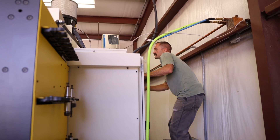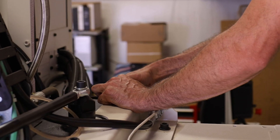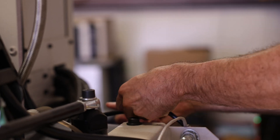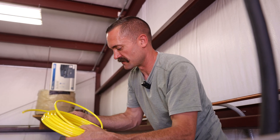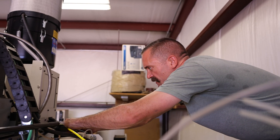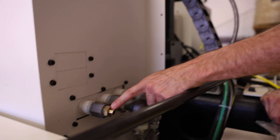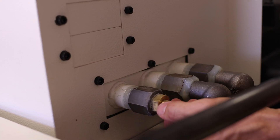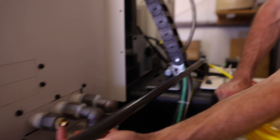We've got a simple little 8mm quick connect T — airline T. I'm going to cut this 8mm air line over here. We're going to plug in the new line. I'm going to use some yellow line just so that I know that it's the line that I modified, just in case this all doesn't go according to plan. We're going to run this line into the machine cabinet through this fitting — one of those barbed brass fittings set up for an internal washdown hose that we're not using. I just parted it off on the manual lathe, reamed it real quick, opened up the bore so that it would accept this 8mm line.